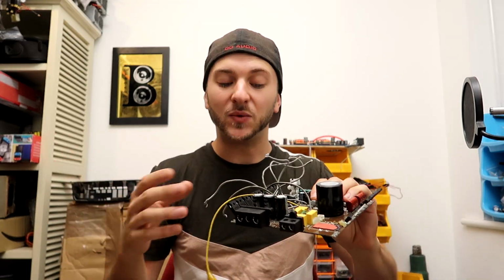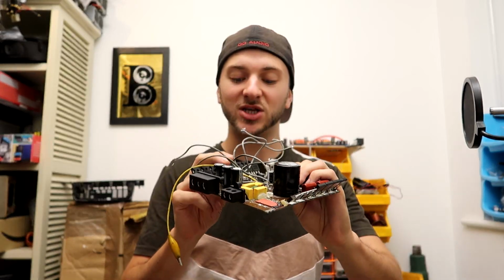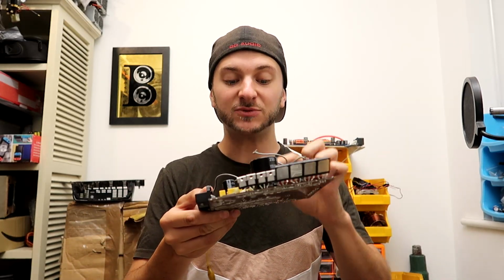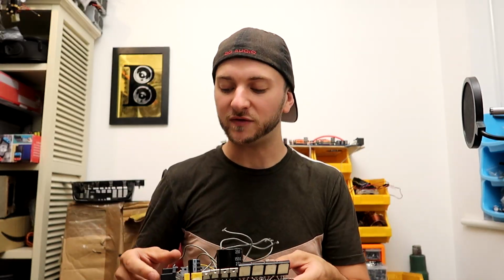So, at the end of the day, we're going to be limited to whatever frequency these MOSFETs can switch at anyway. Like, these are some pretty beefy MOSFETs and they're quite slow to turn on and off. So I imagine we're probably going to end up hitting the speed limit of the MOSFETs before we really reach the speed limit of the transformer anyway. So maybe using Litz wire was a bit overkill in the first place.